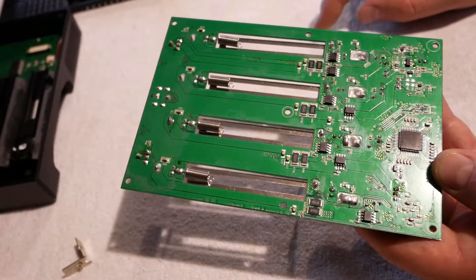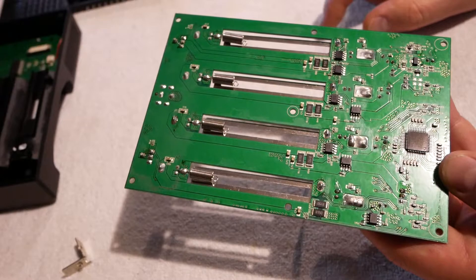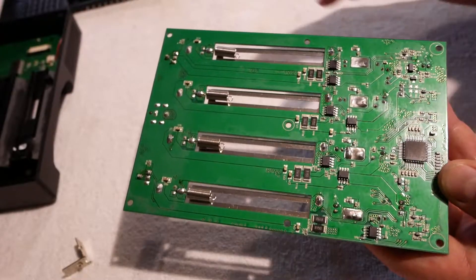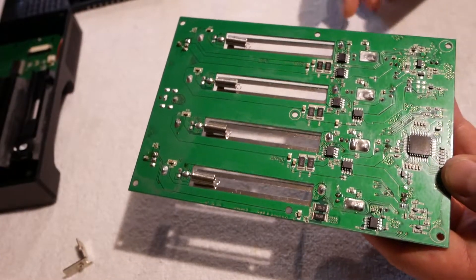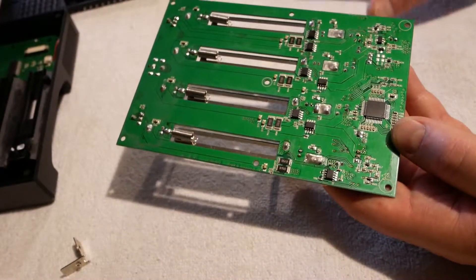I honestly think that the way they're doing it is they're faking it. Ohm's law — voltage divided by current equals resistance. I think they're probably doing something like that. They know what the cell voltage is, they know what the current draw is through the cell, so voltage divided by current gives you some kind of resistance. And then they display that as the cell's IR, which is not really how that works.